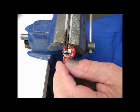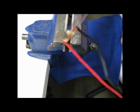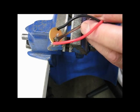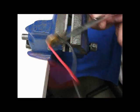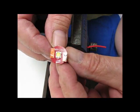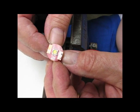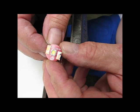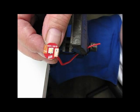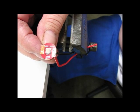Now I have a wire on there — take a look. I have both wires soldered and they can go straight through the heat sink. I have an almost flush set of contacts so I can put my reflector on and not have to worry about shorting anything out, while still being able to use 18 gauge wire. Anyway, that's a little trick I've come up with and it seems to work out fairly well. Thanks for watching.